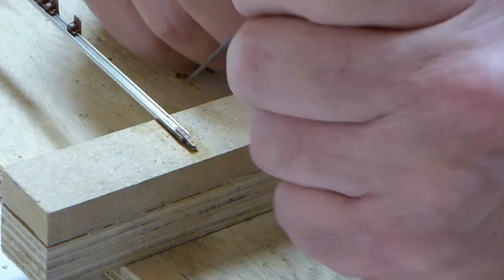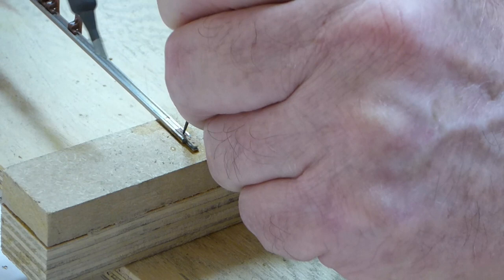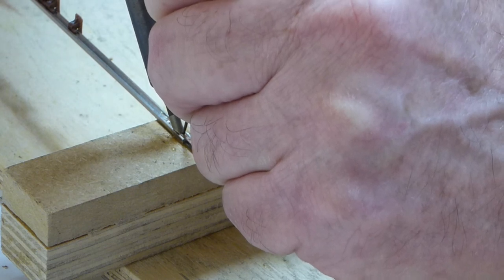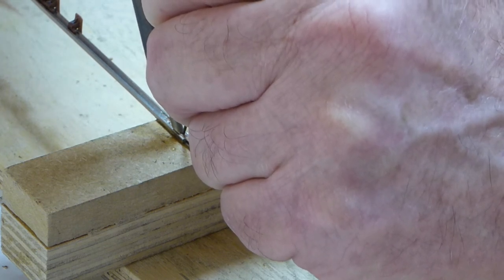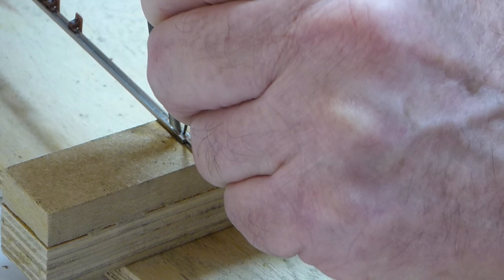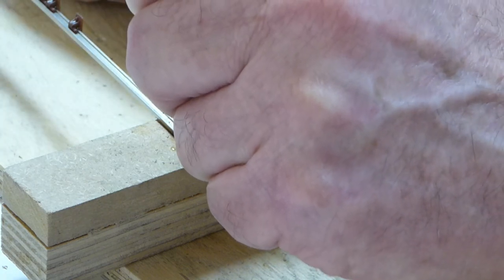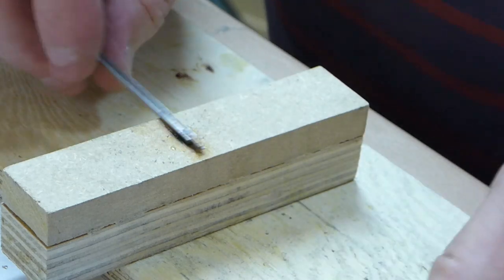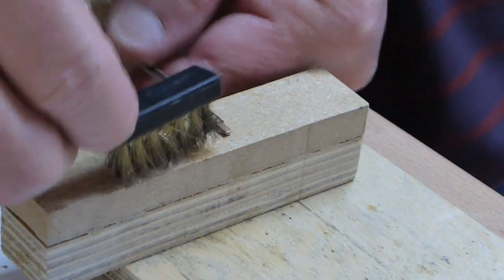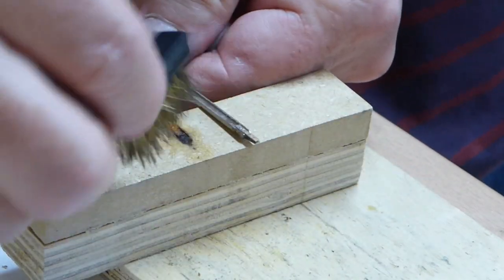And again, I'm just going to position it on as nicely as I can initially. And I'm going to get my tiny needle file, hold it in position, hold the clamp together there, keep the weight on, press down, get my iron on. Here's the solder, and the flux boiling, see the solder going nice and bright and shiny, and we know we're there. Keep pressing on the needle file, just while it cools and the solder solidifies. Have we got a good joint? Looks like it to me. Let's test it with the wire brush. Give it a brush there. Yeah, I'm happy with that.